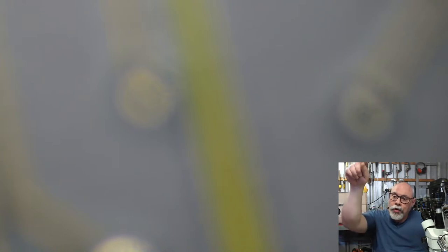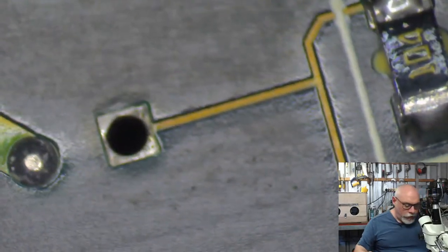So you've got the 5.1 and you've got the 5.5. What you do is you connect the SCSI 5.1, the one that I sent you, to the SCSI to SD utility, and from the menu you go load from device, and it'll load all the settings from that 5.1. Then you disconnect the 5.1 and plug in the 5.5, and then you go save to device. So you've essentially pulled all of the settings from the 5.1 and saved them to the 5.5, and then it should work. Then you should be able to put that original SD card in there, and it should recognize it and understand it and know what it is, and it should be fine.